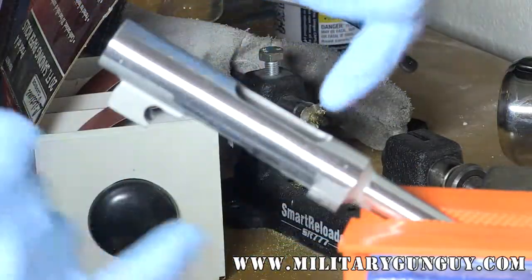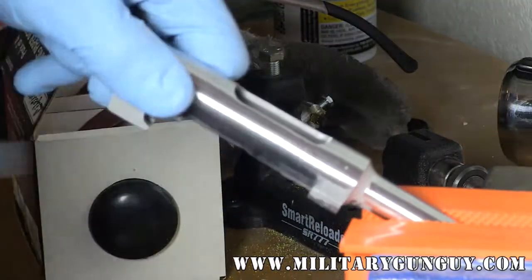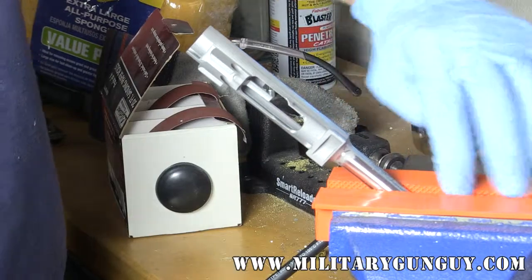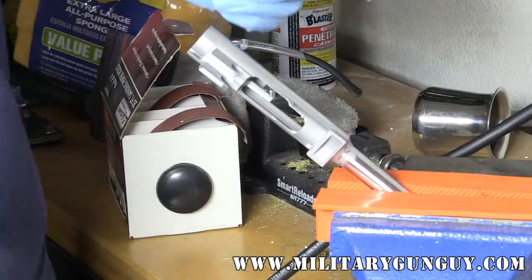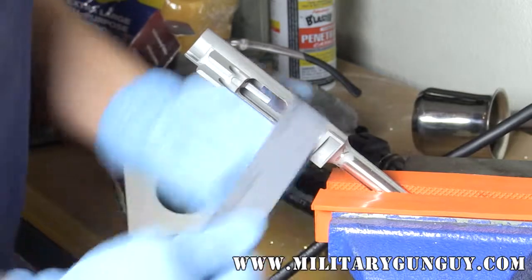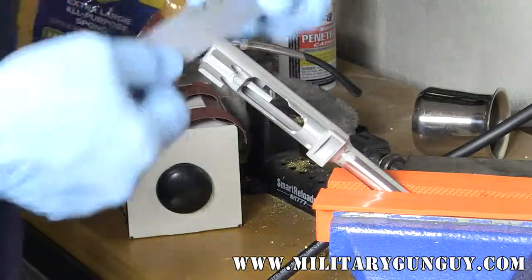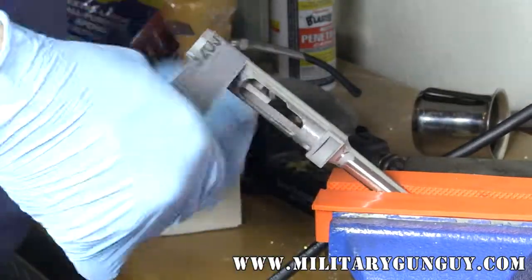You can see the areas between the polished and non-polished sections. I picked up these vice jaw blocks on eBay — they're great because you can clamp your part hard and it won't scratch it. Some people use an old t-shirt, but these are about five bucks and work much better. The vice I got from Lowe's for about $50. When blending, you use a shoe shine motion and basically pick up where the belt sander left off, blending the areas by hand to give it a nice uniform matte finish.